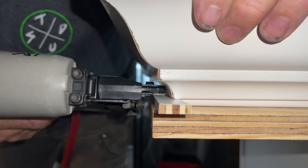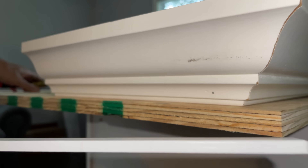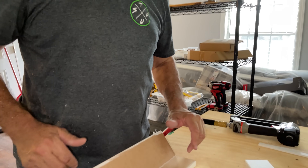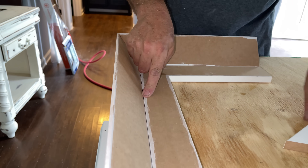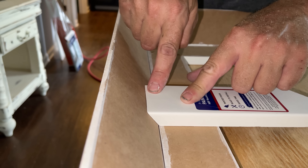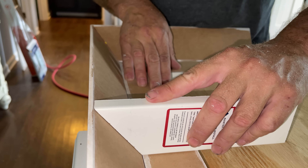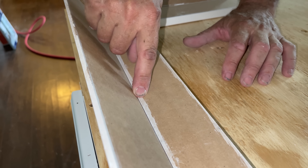Let's do the other side, then we'll do the front. We've got it all nailed off. Our reveal is perfect. Now check out the top side to see what it looks like. We have a pretty small crown, but if you had a taller crown and wanted to make it stronger, get a piece of wood, cut it at the right angle, put it in right there, fasten it to your nailer — now you have something to either nail the crown into or glue it. You've got a really tall crown and it's really strong. But since our crown isn't that tall, we're just going to put a bead of 2P10 right there, hit it with some activator, and this thing is ready to install on that cabinet.